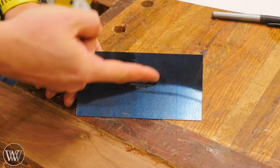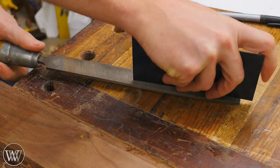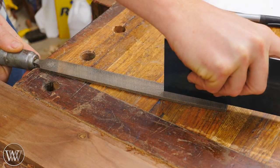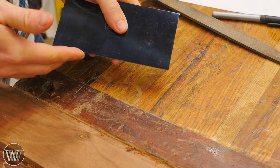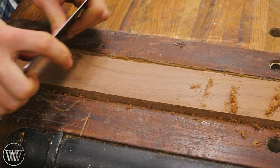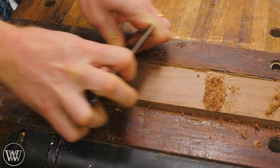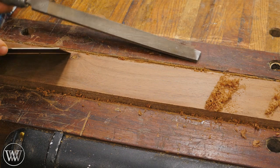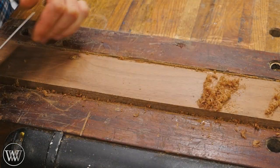The first thing we want to do is make sure we have a flat edge and a flat edge on the back, and make sure these corners are nice and sharp and perfectly 90 degrees. I also want to make sure the top edge isn't wavy — I want it straight all the way across. To do that, I'm going to grab a file, set it on here, and with just a few strokes run it across. This will flatten out the top very quickly and give you a nice straight edge. It will also sharpen these corners a little bit and create a bit of a burr. With that little bit of burr from the file, we can actually get some shavings — pretty heavy shavings. This is a really strong burr, and it's not going to give an incredibly smooth surface, but it will take off a lot of material quickly. So if I'm trying to get down through tear out, I'll just use this file.